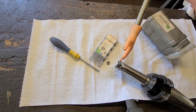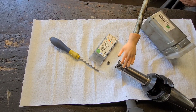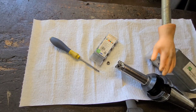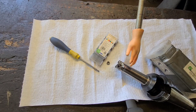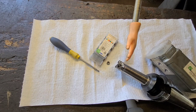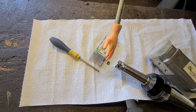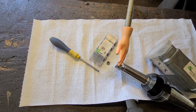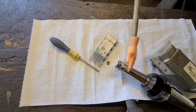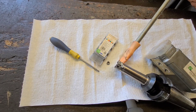It's come time to change those inserts out on the high-feed cutter. What it is, is an ISCAR FF EW D1.00-3-3.0 W1.00-05, and that tells you it uses the 5mm insert, it's 1 inch diameter, and it has 3 inch projection on it. So this is one of those high-feed cutters.